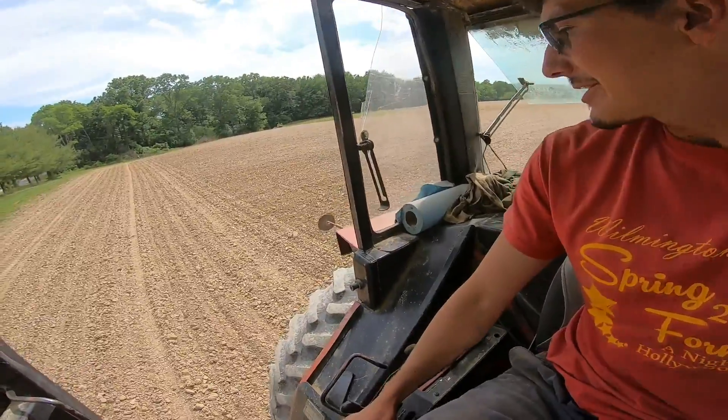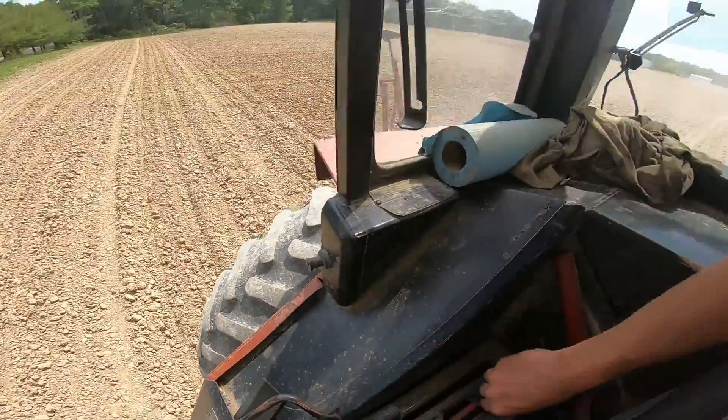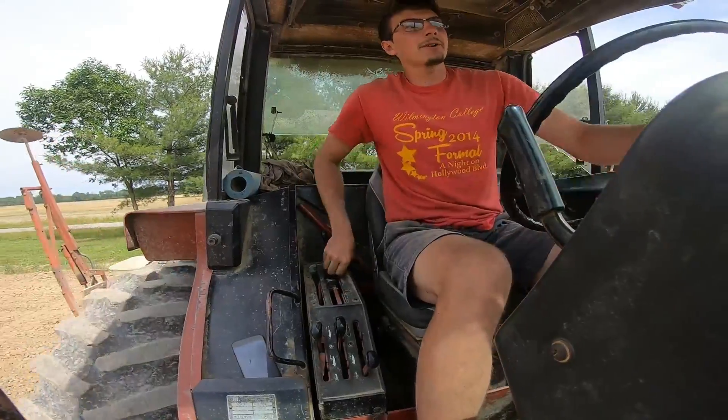So we're coming to the end. We cross — hopefully we can see our tire tracks. We've got one right here and one back there. Once this tire crosses, we go ahead and pick it up. I don't usually stop so much, but since I'm trying to shoot some footage and multitask, we'll slow down. We drop the marker, and as we're crossing those last three rows we set the planter down. Give a little fuel and hope our marker mark isn't lined up with the disc furrow, because my Uncle Jim disced this field. Usually my goal on the last pass of disking is to go at an angle to how we're going to plant, so the marker mark doesn't get mixed up with the furrow.